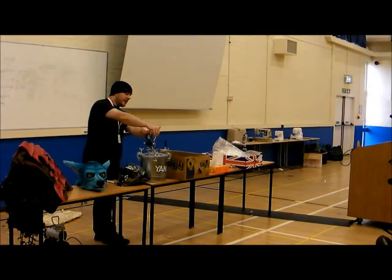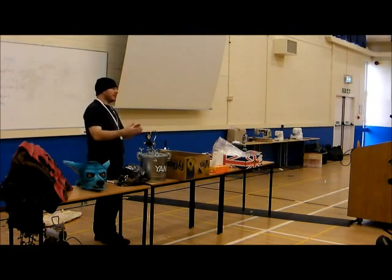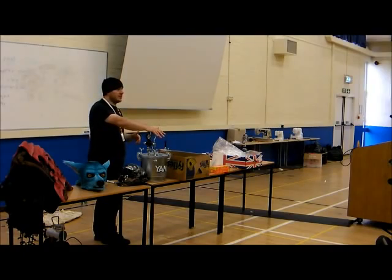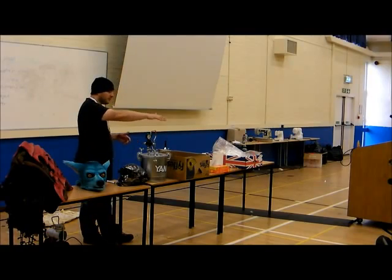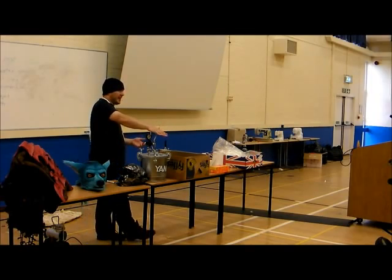This little piece of kit is about £170, and if you're going to do a lot of casting and you want it to be perfect casting and you want it to be beautiful and you don't want any bubbles in your clear resin or even your standard resin, because bubbles in the standard resin will cause it to be weak and fracture. Doesn't matter if it's a thing that you're going to wear a few times or use a few times, but if you're going to make something beautiful, you want it to last. Pressure tank's a good investment. It will do you well. They are really hard to find, though. Axminster for that, eBay for your compressor.